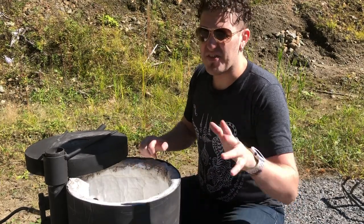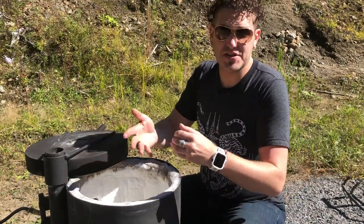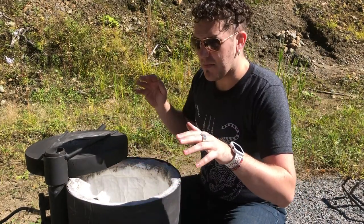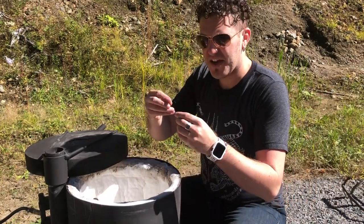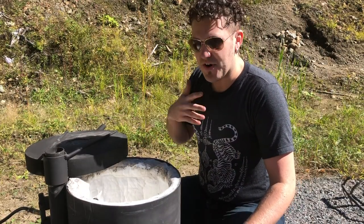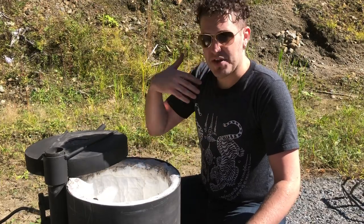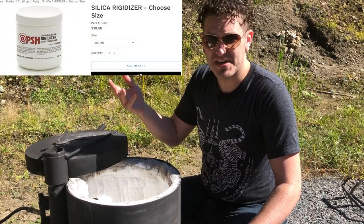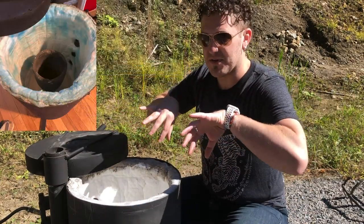To help stabilize it — and I know this is a little bit controversial because I've heard both sides — I tend to err towards caution because it makes sense. I've heard manufacturers say this stuff is not dangerous, and I've heard others say it's the worst thing ever. Basically, if you cut it, the ceramic can break apart and create little spores that get into the air, and if you breathe it, it's very bad for your health — you can get silicosis from that. There's a product you can put on top of this called rigidizer, which is essentially dissolved silica. You paint it on with a paintbrush and it keeps those spores in the material.